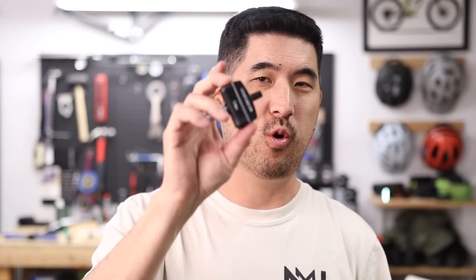Okay, so there you have it. The humble torque key actually turns out to be pretty repeatable and pretty accurate. This is a fixed torque tool, which means it can only click when it reaches 5 Newton meters, but that's actually a good thing because there are many applications on the modern bicycle that require 5 Newton meters of torque. Destroying this older Competitive Cyclist torque key did feel kind of blasphemous, but I think it did shed some light on how these tools work — now we know that torque keys in general are length independent, which means in addition to being repeatable and accurate, it doesn't matter where you hold the handle when you apply the torque. You're always going to get 5 Newton meters applied at your fastener. All right, so that's going to do it for probably my fifth video on bike torque wrenches. Hope you enjoyed it. If you have any questions, let me know down in the comments. Thanks for watching, thanks for subscribing to the channel if you haven't already, and I'll see you next time.